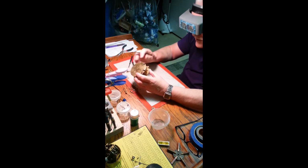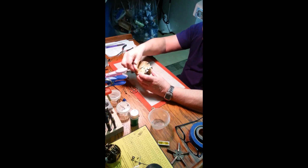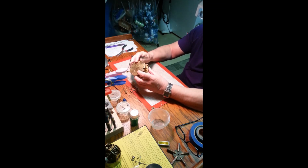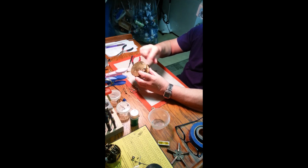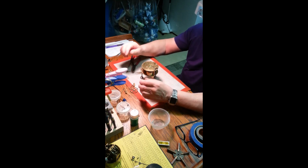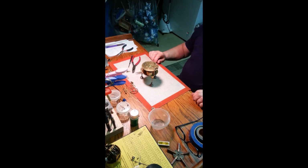And then I locate them, and then when they're in, I put a pin in, or if it's a screw down type, I screw it down a little tighter, little tighter, little tighter every time I get something in. I screw it down a little tighter until I get the last one in. So right now everything is in place. It's just a matter of me now reassembling some of the other parts of the clock and doing some testing.